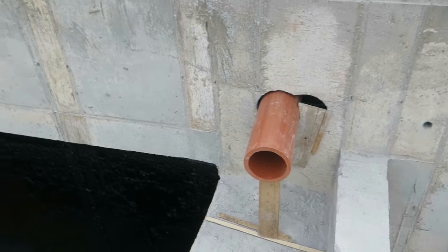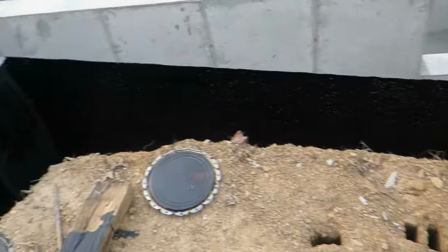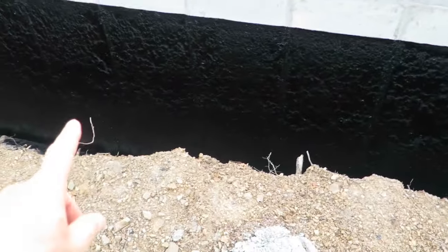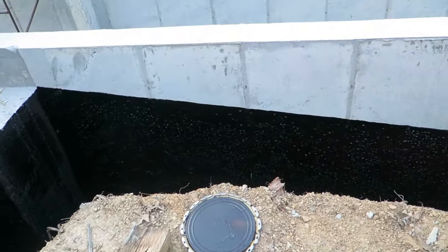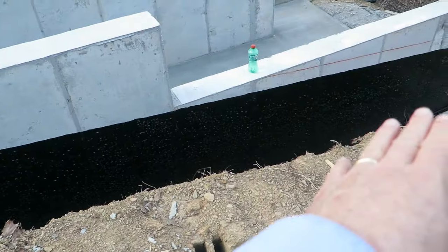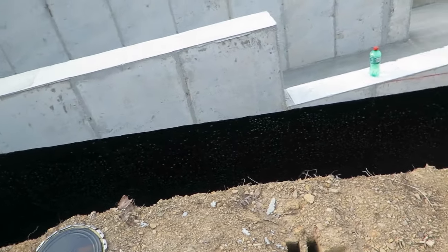I left this portion here up enough to pour into. I'll put a dry mix around the edge and let that set up for a day, then pour a runnier mix in so it'll go underneath, up, and around — just pack that full of mortar. I'm just waiting on that. I also finished out my second coat of tar all the way around. It's nice and thick and sagging — good solid sixteenth of an inch of tar on it.